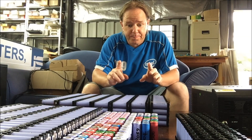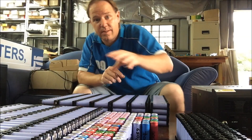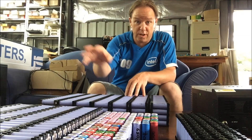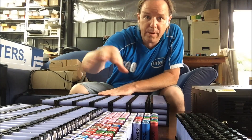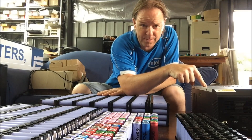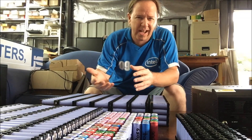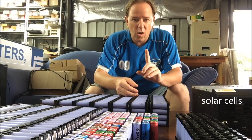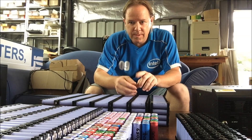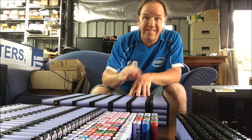The charger does 60 amps, so does that mean I only need a 30 amp BMS on each pack? Bearing in mind I've already got access to more cells and I'm going to add another two packs. So I should only need a 30 amp on each, because the charger only does 60 amps total — it's going to dissipate a maximum of 30 amps per pack, and it's never actually going to hit that maximum.